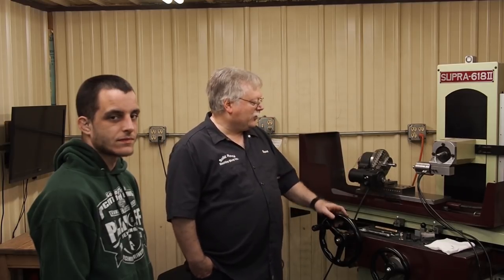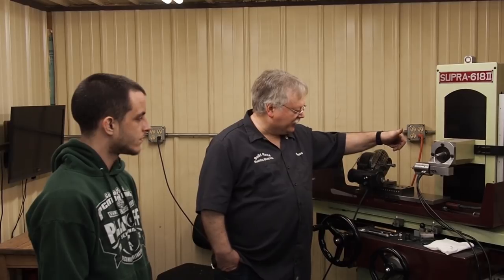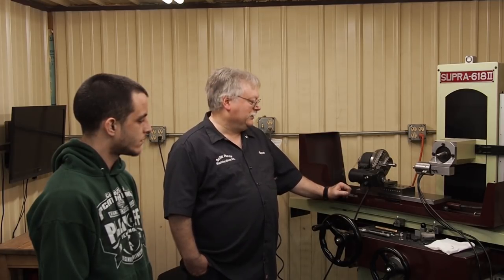And so anyhow, that's how you're taking a Planet 550 air spindle, 60,000 RPMs, 70 thousandths diameter CBN wheel, starting out with an 80 thousandths hole and cleaning these up to the tolerances that we were shooting for. So everything worked out good. I'm pretty happy. Hopefully Mike's happy.